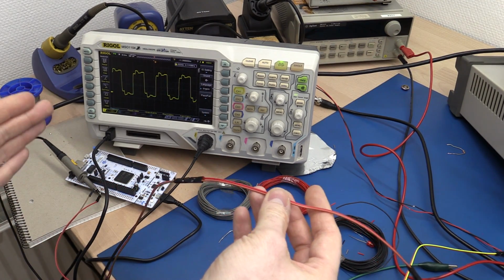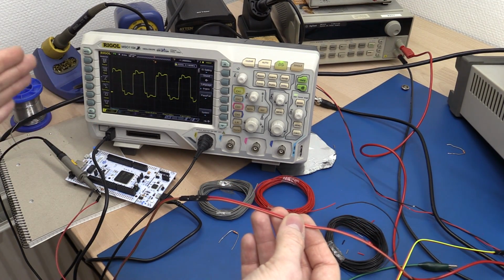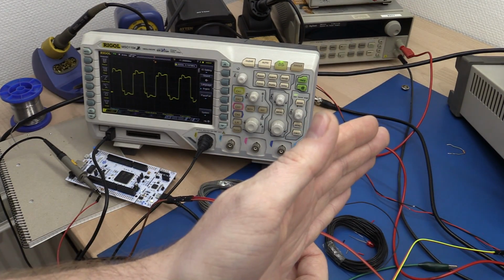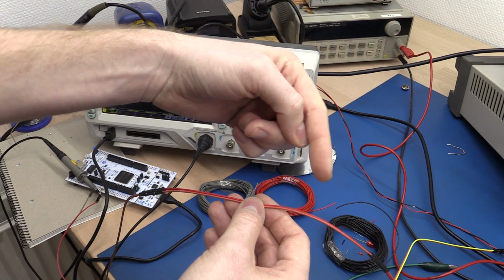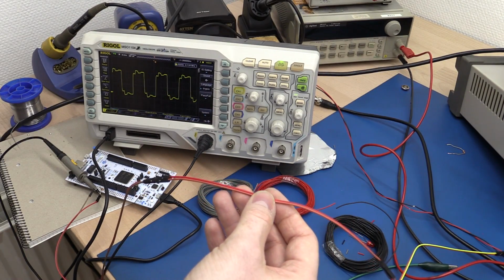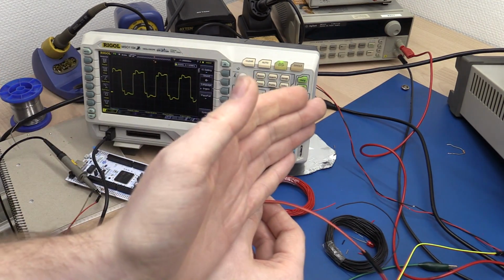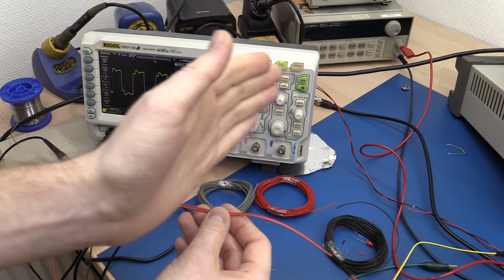But we have to know that this voltage starts here and travels down the line, and once it hits the other end we can measure it. But what happens if we disconnect the battery again before the voltage reaches the far end? Well, the thing that we have sent away already doesn't know that we disconnected the battery, so this will just continue to travel down the line.